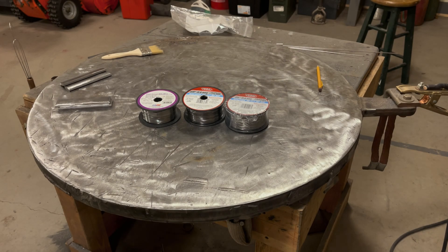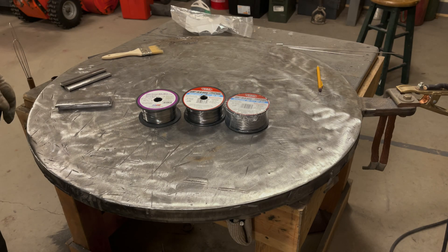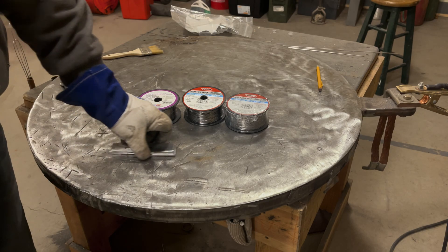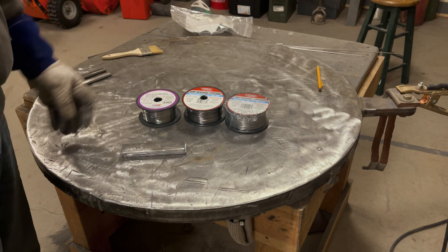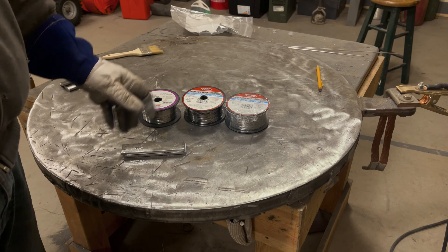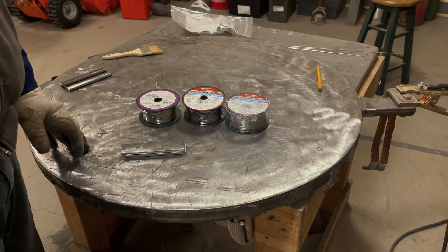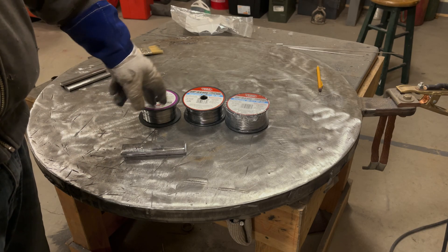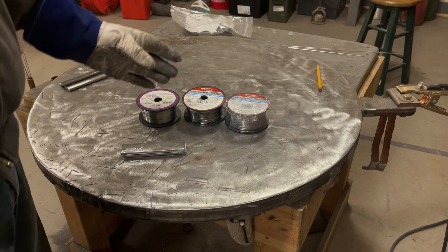Good morning YouTubers. On today's episode, which is part four — we'll call it 4.75 — we're going to go back and revisit the previous two videos where we welded quarter-inch thick steel with the flux core Titanium 125 from Harbor Freight. My recommendation: watch the two previous videos, come back, and watch this — it'll make a lot more sense. In the first video we had a ton of porosity; second video I switched to a different wire. In the first one we were running US Forge; second video I ran .030 Lincoln Electric NR211 wire and porosity was a lot better.